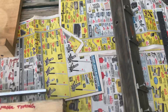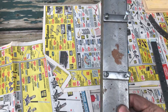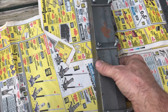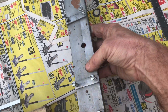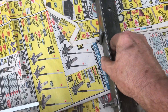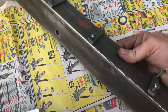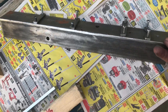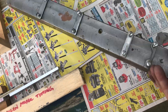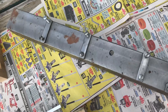Speaking of the side rods, here is a little jig that I made. It's a piece of angle iron — probably 2 inch by 3/16ths inch angle iron that I machined so that it's a good 90 degrees. I even machined the inside and milled it. I could put it in the vise on the milling machine and used these straps to hold down the side rods while I machined them. I just drilled and tapped on the inside. This actually was a piece of the old bumper from an old pickup truck — a farmer's homemade bumper. I cut it off and saved it all those years. Never throw anything away, especially if it's heavy duty and potentially useful like that.